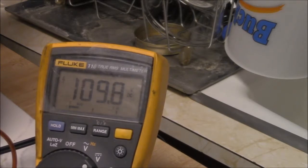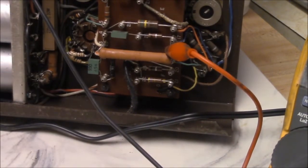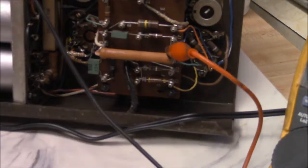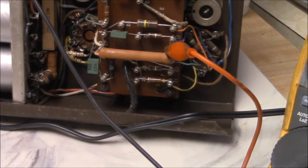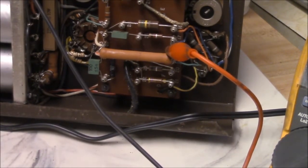I think the body of that resistor, there's actually something wrong. It's probably a helical wound. That may actually be an actual wire wound resistor, I don't know. Anyway, it's screwed up. That's going to be fun to replace, because it's going to be hard to match up physically. I don't know where I'm going to find a 44K resistor at 7 watts. I'm probably going to find a 44K resistor at 10 watts, or two resistors at 5 watts, or it's going to be a pain.